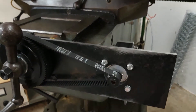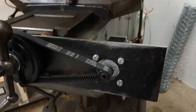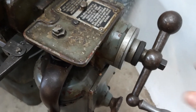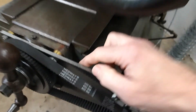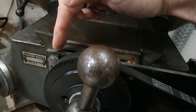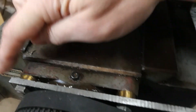That's it for the pulleys and mounting. I hope you've got something from that. The plates themselves are fairly straightforward — it's just a straight plate. You take off the graduation wheel, and in place of that you've got enough width of shaft to put the pulley. The plate is mounted onto the same four screws — from memory, 5/8 British Standard Whitworth cap screws — and I've just changed those with ordinary bolts and put a spacer in so that the plate is stepped away. You can see how this fascia here has got a bit of a curve in.